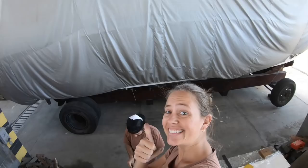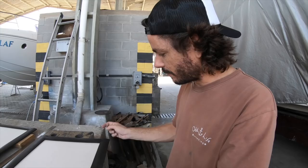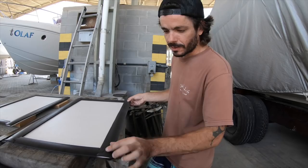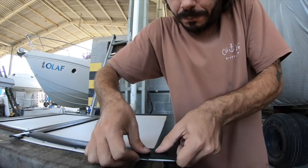So now the scariest moment so far. Yeah, we need to do the holes. The strategy is gonna be to mark the tip, one, do the hole, and then locate the hole, mark the other tip, do the hole. Because the most important holes are these two, this and this. If they are right, they're gonna compress these two pieces together. If they're wrong, they're gonna just pull this apart.